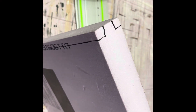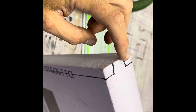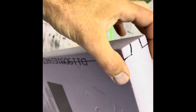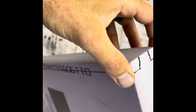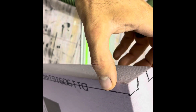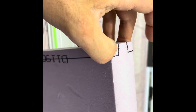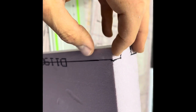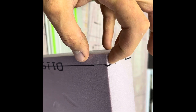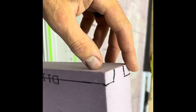These black lines illustrate where I'm planning to cut, and you can see the shape of that inner groove from the cooler. I took the two-inch thickness and I subtracted seven-eighths of an inch, which is the distance from this point to that point — that gave me nine-sixteenths. That's going to be the depth of my cut from each side. The track saw blade thickness is three-sixteenths, so I'm going to set the saw for three-quarters of an inch, which should bring the blade down to that corner at nine-sixteenths deep. Then I'll find this angle and use the table saw to make that cut and remove those pieces.